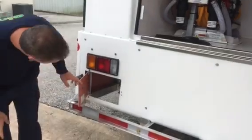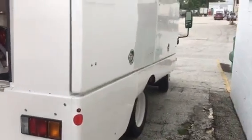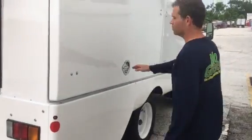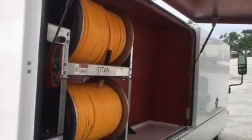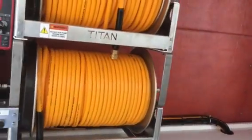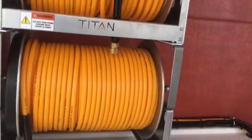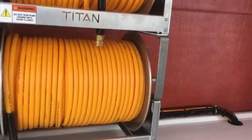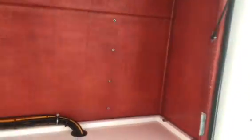And Jeff is showing where the little fill port is for both the drop tanks. Little fill valves. And I'm kind of running out of room on this side, but here's the passenger side. We have stacked hose reels for the shrubs and the lawn, and we decided to use 400 feet of 3/8 hose instead of your standard 300 feet of 1/2 inch. I'd rather have the length and crank the pressure up and get plenty of volume out, even using the 3/8 hose.